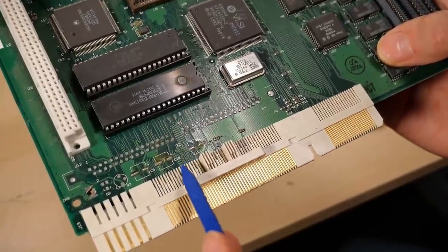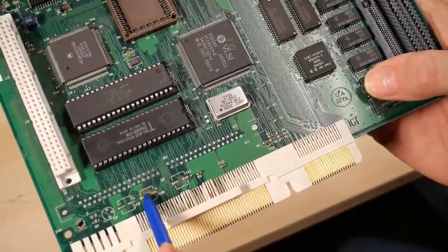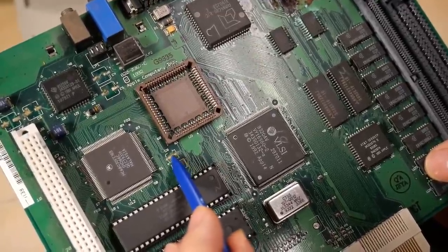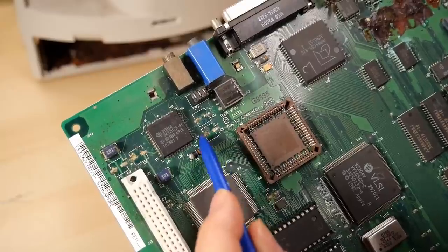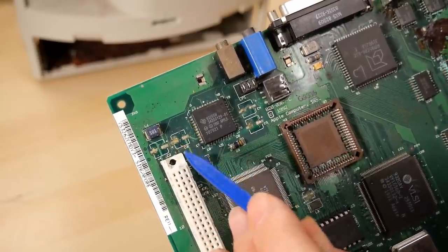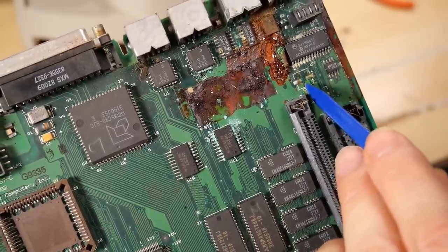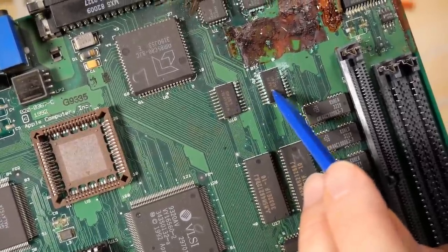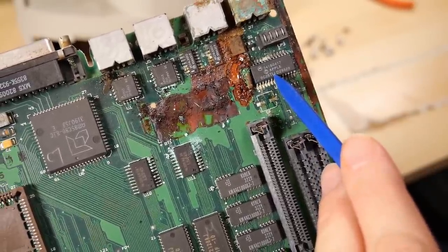The caps came off perfectly, and of course they are leaking, so most of them just sort of fell off — they hardly did any twisting at all. And you can see here it's all crusty and nasty under there because that one has been leaking. Same for this one up here — look at this mess. Hopefully there are some traces that run through there; hopefully they're okay. And up here it's exactly the same story — looking disgusting here as well. In fact, I can definitely see some damage to traces there. And there was one cap right here by all this leakage, and it looks pretty bad. Look at this green corrosion on these chips here. Luckily these are standard LS chips, so these are easily replaceable. Unlike stuff like this one up here, which is a special Apple chip, which would have to be taken off another motherboard.